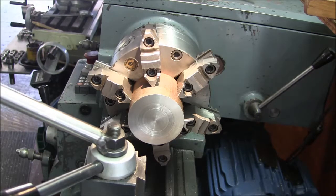The chicken sketch says that hole has to be 0.625 deep. I think I'm going to use a center-cutting end mill to give me a flat-bottom hole. Let's set that up and see what happens.